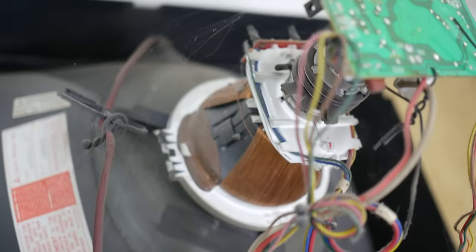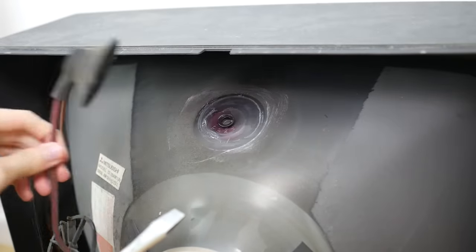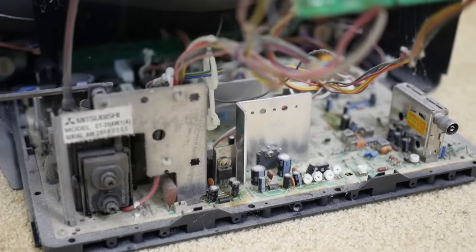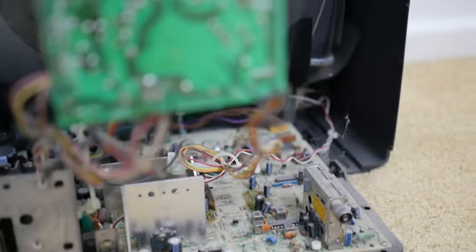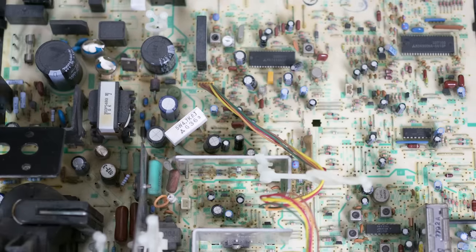The inside was filthy, packed with dust and cobwebs, and while I did make some efforts to clean it as I worked on it, it remained pretty dirty the whole time. Of course I discharged it, which went well - luckily it was already discharged, which modern CRTs like this tend to be pretty good with, but it is always good to make sure. The next question was where to start. The truth is I didn't know, so I consulted some CRT experts on the internet. The first thing recommended was replacing the capacitors, which we all know will either do absolutely nothing or magically fix everything. So I went ahead and replaced as many caps as I could, of which there were a lot.